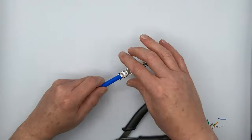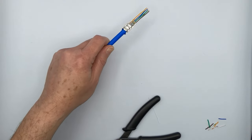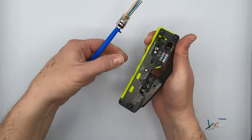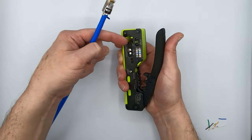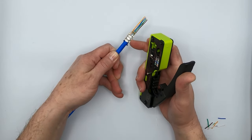The next step is to actually terminate this — that's where the golden contacts get forced down and the conductors get flush cut. Open up the tool. The strain latch presser bar does engage and will go through that rectangular hole, which is fine — it holds the plug as you finish your crimp cycle. Put it in with some light pressure, make sure it's fully seated, then start your crimp. You can take your hand off the cable and finish it. Lock your tool up and inspect your work — the conductors are fully flush cut off the front of the plug and all the golden contacts are indeed down. This is exactly what we want to see.